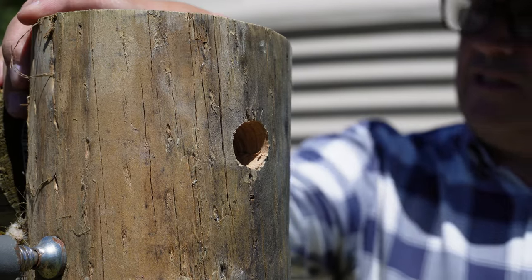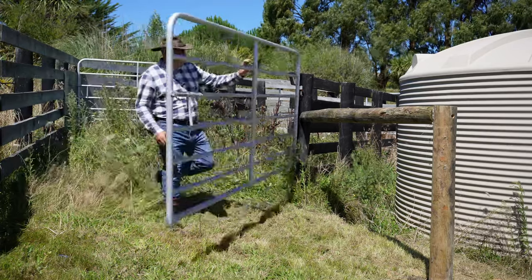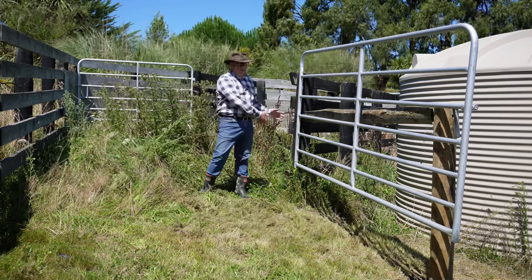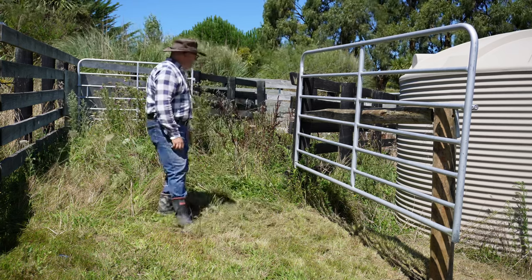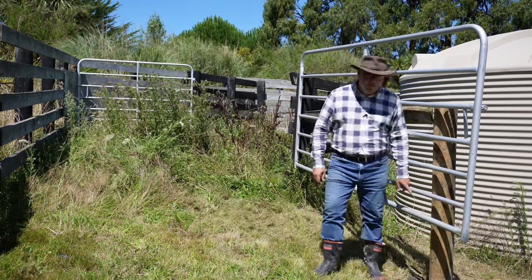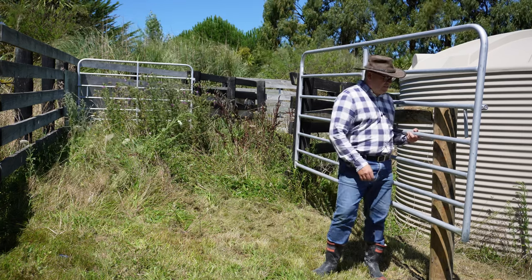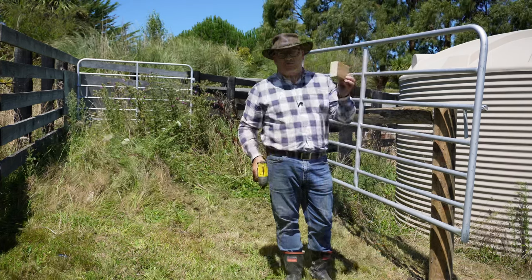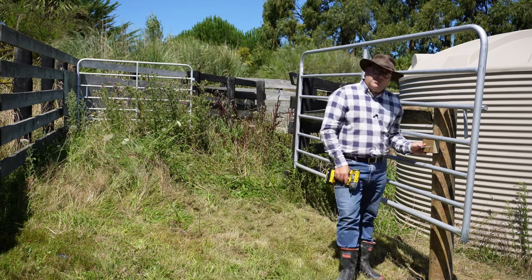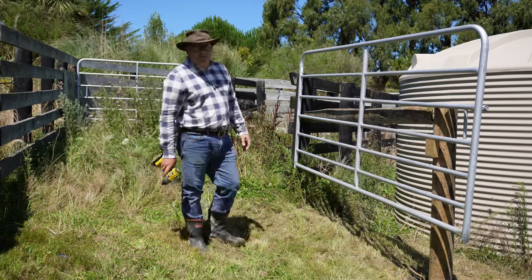Once we get some tension on it, it's going to be absolutely rock solid. When this gate is closed and locked, we've got a pin that actually takes the strain of it. But when it's open, this incredibly heavy gate is going to want this post here to lean forward. Rather than just transferring all of that weight across to the H, it would be really helpful to put a foot down here — and that's what we're going to do now. With a bit of scrap 4x2, pre-drilled, I'm going to put a couple of these really strong bugle screws in. All this is going to do is give us a little bit of extra distribution of weight downwards from the gate when it's open.